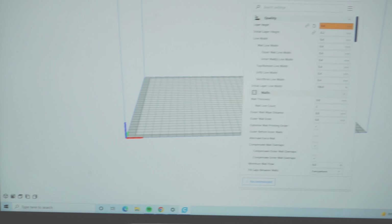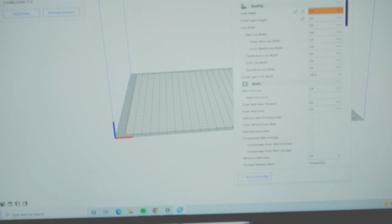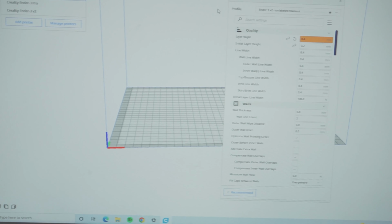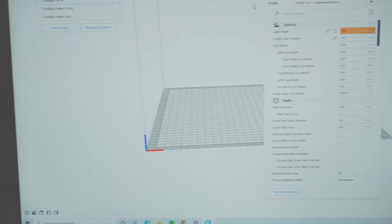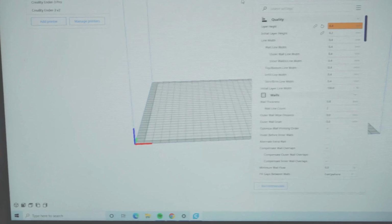And that's it. So now every time you configure something in Cura, depending on the printer you set it up for, it's automatically gonna put those G-code commands in, which in turn will trigger a GPIO pin on your Raspberry Pi, which goes through the transistor to the relay and turns your printer on or off.